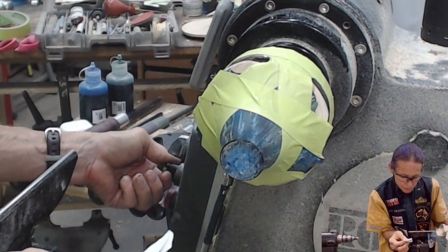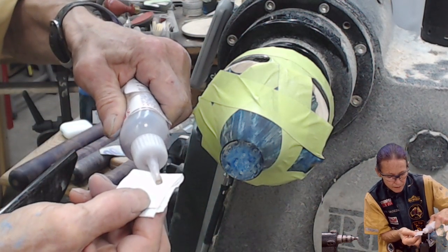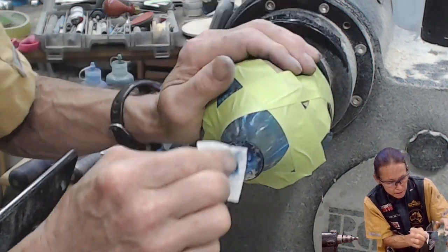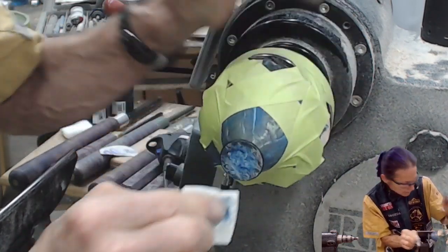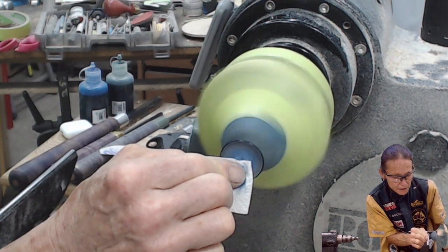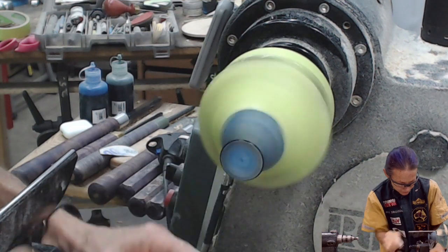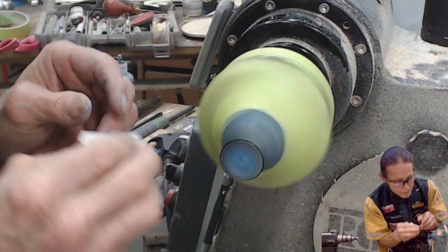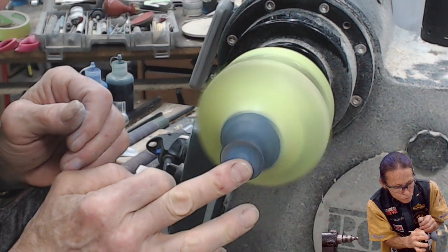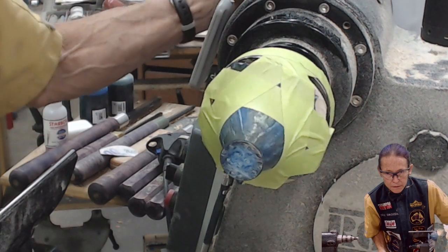I'm looking for it to be really smooth and shiny. I think another just a little drop of glue on a paper towel and smearing it on the wood. Start the lathe up and put on some pressure to kind of get it to cure. Once it's cured I'll use some 1000 grit just to sand smooth mainly the surface of the foot. So there's what we have now — looks great.